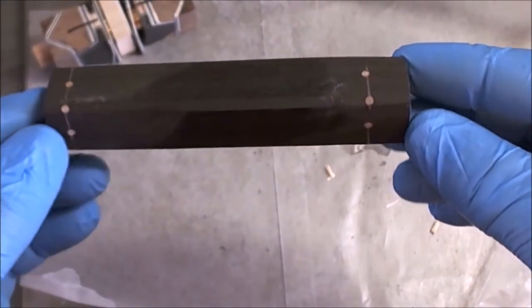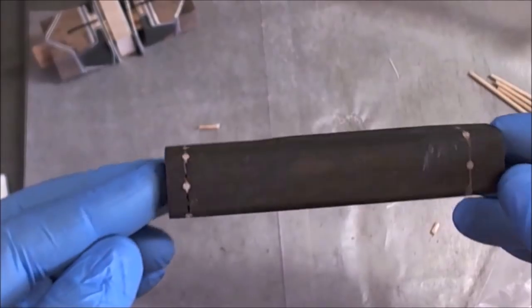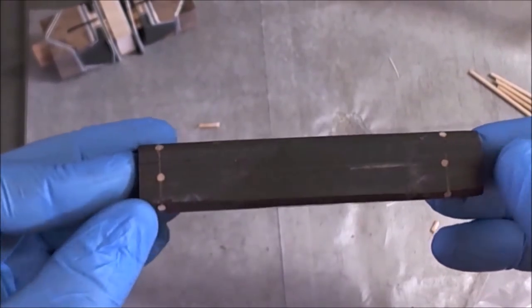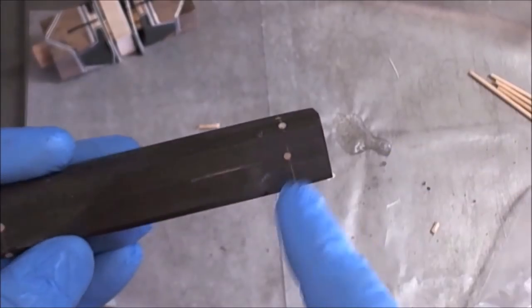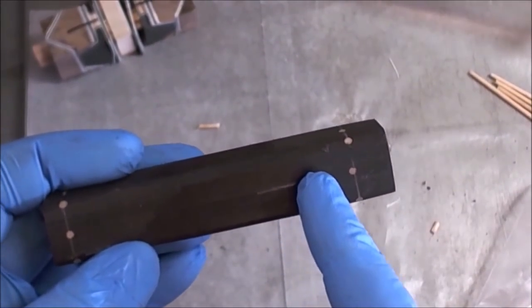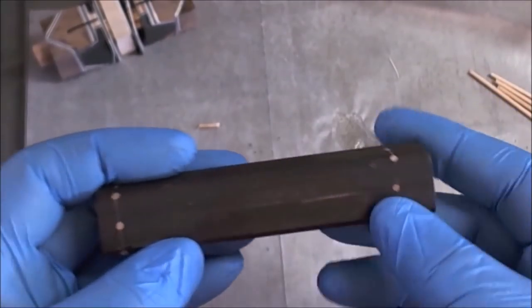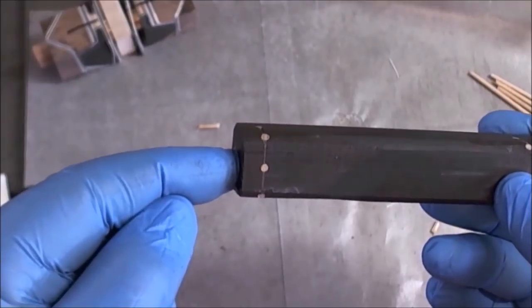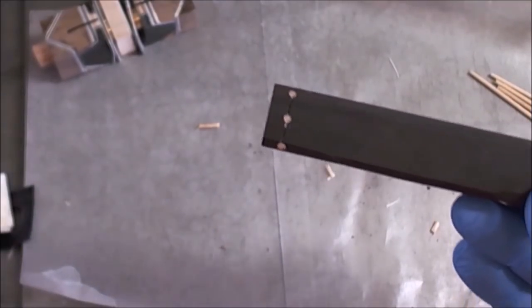Okay, now those are sanded off. That looks pretty good, nice and even all the way around. So now all I got to do is cut a quarter inch tenon on this side and leave a quarter inch off, and then cut off a half of an inch after I drill out a hole for a tenon for the Churchill, the upper and the lower.